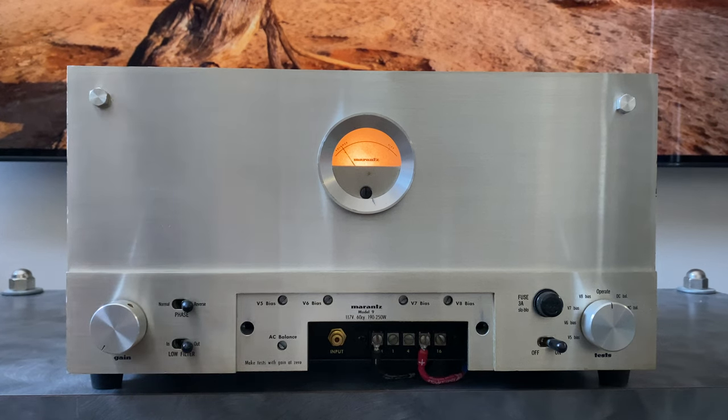So I guess the idea was, back in the day, if you have a very large room with two speakers on either side of the room, that you can't step far back enough to get a stereo image, or the space is just so big, you get an empty hole in the middle and it sounds kind of disjointed, because you have a left channel and a right channel and there's nothing common between the channels. So one of the solutions they had was adding a center channel speaker that would get a signal that was an L plus R. You get both channels combined together coming out of the center to kind of fill in the gap in the stereo image.